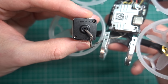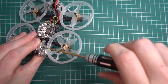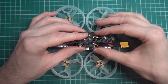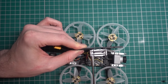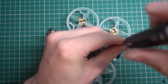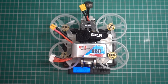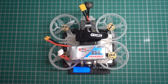The camera is labeled with which way up it should go, but if you get it wrong you can flip it in software. I could only reach two of the four screw holes without completely removing one of the protectors. The top plate goes in and there's just enough room for the little nuts to screw on - I use my fingers first and then a small socket to finish them. Dry weight with the battery strap is 125 grams. With a 4S 650 milliamp battery it's 207 grams, and with a 3S 650 milliamp it's 188 grams.